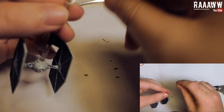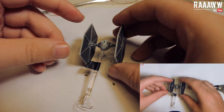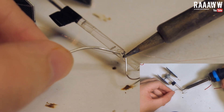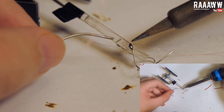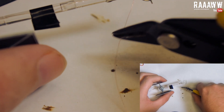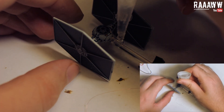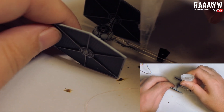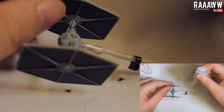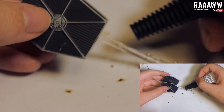We now need to solder the wires to the connector. To do this, stretch the wire that is above each connector as straight as possible, then wrap it around the connector a few times at its base and solder it into place. Do this for both connectors. Cut any excess wire off. Now put a lot of super glue above the wires to shield them from any harm. If you use any tape, I recommend removing that before gluing — the better the glue flows, the clearer it will be. Remove any excess but try not to smudge it around. Make sure that you cover the wires so they are much less likely to break.